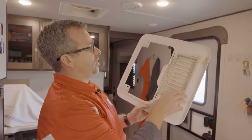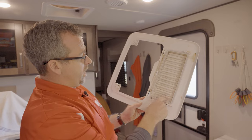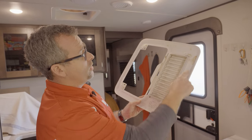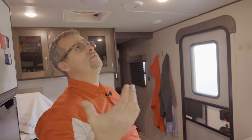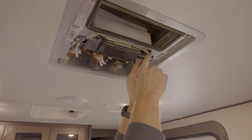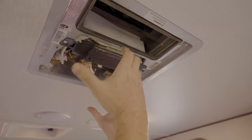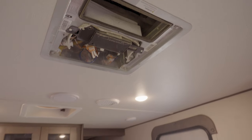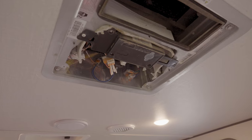As I was pulling this cover down, I did notice that we have a lot of, I don't know if you want to call it mold or black mold, but you can see it. It's definitely there. We had some leaking in here and condensation. And this is something that's very important: when this center divider does leak like this, cold air comes in here and starts condensating right down in here, and water drips out of the ceiling and into this device or cover, rather than the evaporator coil condensing to allow the water to go on the roof and escape.